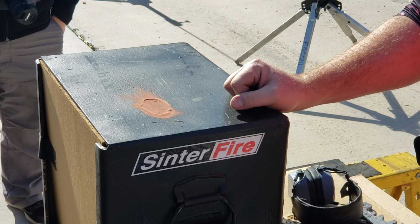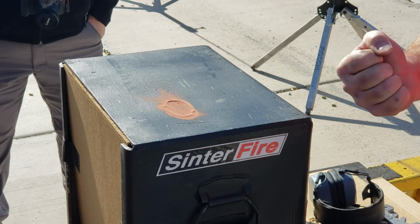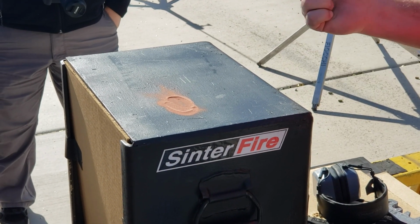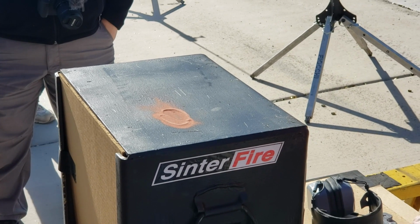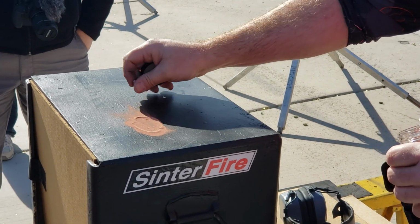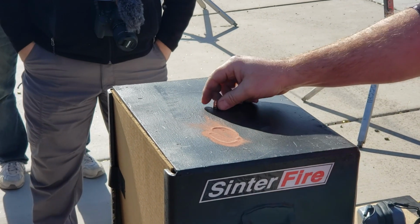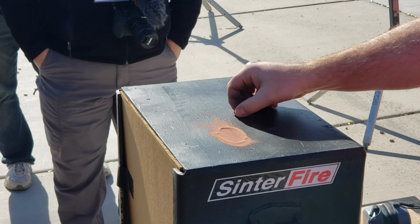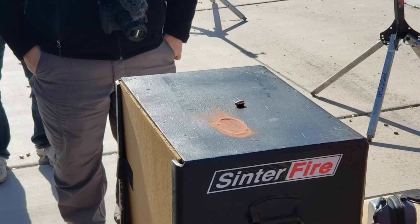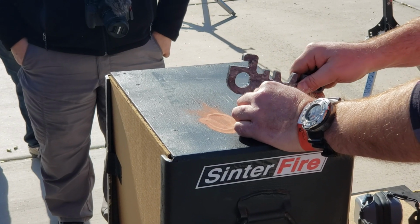It's not a copper strip, it's not a wire, it's not machined, it's pressed. It's metal powders that are compressed under a lot of pressure. They'll go into a press, they'll come out, and they'll look like a shiny new penny, just like that. And when they come out of the press, when these two metal powders are combined, this is what you get. Looks just like a 9mm bullet. And forgive my hammer, but this is the best I could do with short notice.